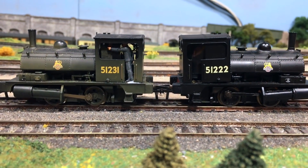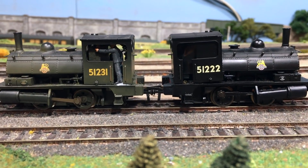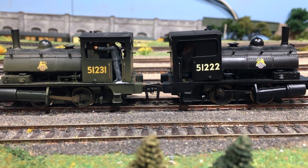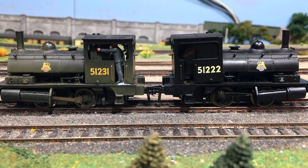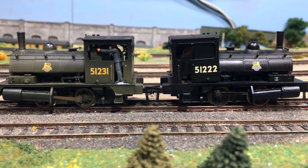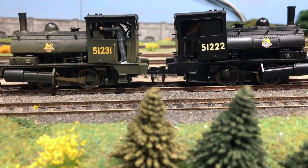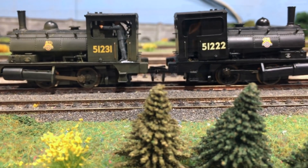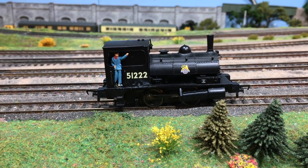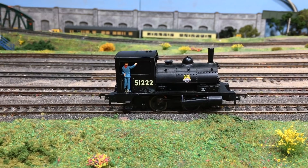I'm incredibly pleased with what these smart power packs from Train-O-Matic have done for this locomotive. Finally my favourite locomotive is DCC enabled and boy does it run well. The one on the left is just a plain straight DCC fitted and does struggle. The one on the right — the clip on the cab has actually pinged off, so I'll use a little dab of super glue to get that stuck back down. You can see there's no light visible through the cab; I've used black tape to hide the electronics. I'll also try to fit that driver figure back in to pull the eye away from the blackness in there — a small price to pay for having a DCC-ready ex-Lancashire and Yorkshire Pug.